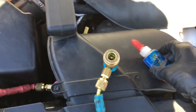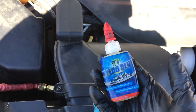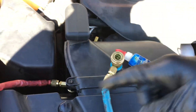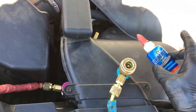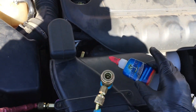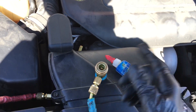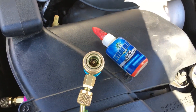That's it — just a quick tip. Nylog blue or Nylog red from trutechtools.com — you guys can get this stuff and it's an excellent protectant for all your o-rings when you're assembling your pipes, tubes, gaskets, and seals. Your alternative: mechanics usually always have dielectric grease — the silicone grease you put in your spark plug boots — that's another excellent thing to lubricate o-rings with before you assemble hoses and pipes. That's your tech tip for today.